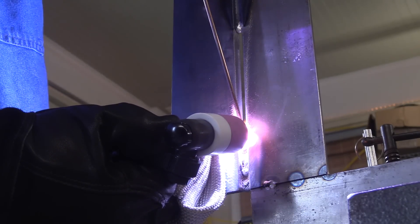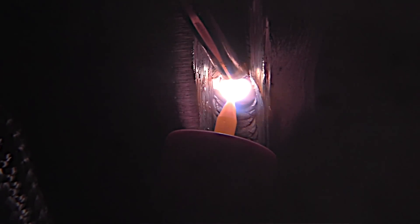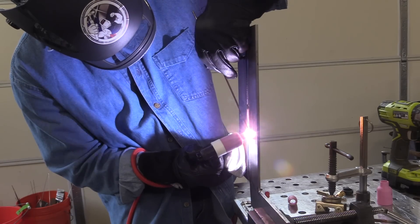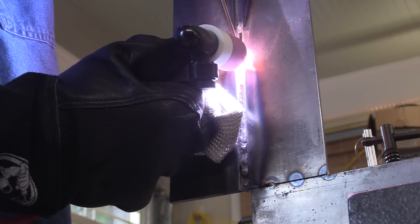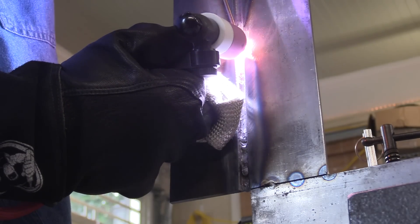That gap has probably drawn shut just a little bit, but the ER70S-6 filler — as opposed to S2 — should help the root flow in there where I get some decent reinforcement and break the walls down. I don't notice a tremendous difference between S2 and S6 when just welding a bead on plate, but in an open root situation where the back side is exposed to air and oxidizes, the S6 seems to do a lot better. Notice that I'm not going side to side at all on this freehand root — I'm only going forward and back. That's a benefit of freehanding: you don't have to go side to side, and that usually helps punch the root in.